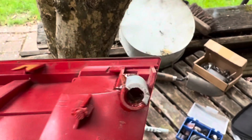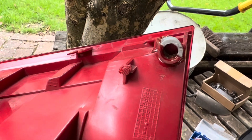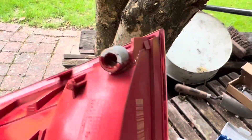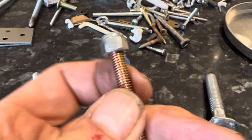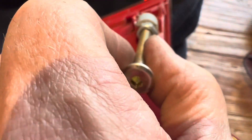We're going to let that dry, and after it's dry we're going to put a threaded insert in there that'll allow the screw to screw in. We may even paint that red — you could even use a red Sharpie just to give it an OEM look. Next up we're going to take a nylock locking nut and file off all of the edges using an angle grinder so it fits inside like so.